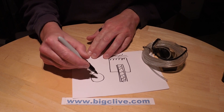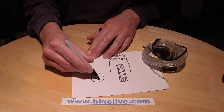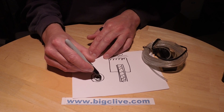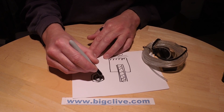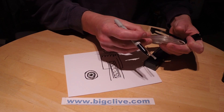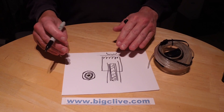In the case of the electroluminescent wire, the construction is a central conductive core — a central wire — then the layer of luminescent phosphor dielectric, an outer conductor, and then a plastic protection film. All these have plastic protection films on them, because otherwise it's very easy to damage the electroluminescent material — they need a protective film against moisture.